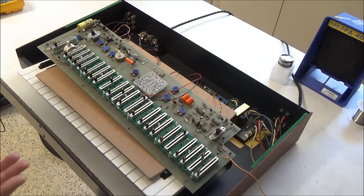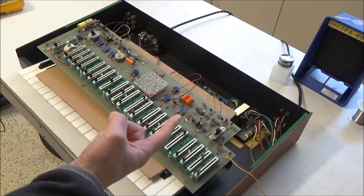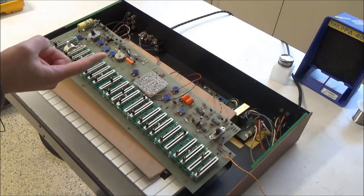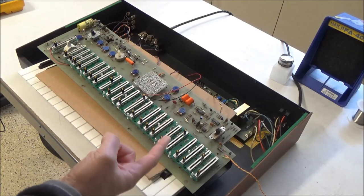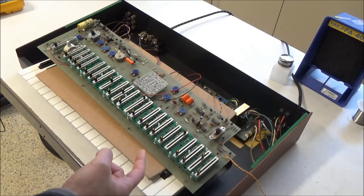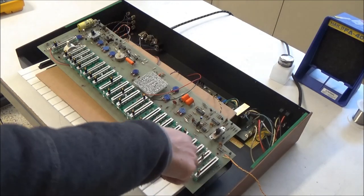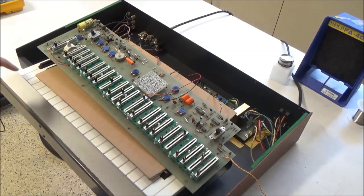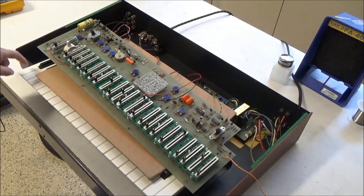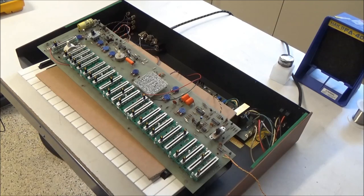We had four issues. We had one note that was always the same note playing regardless of what key. And we saw that was due to a damaged key. Also, the sustain was never releasing, also due to the damaged key. So now those two issues are resolved.